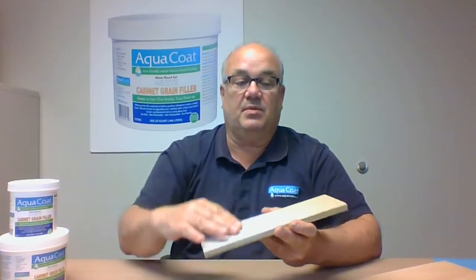The objective of the pore filler and grain filler is to seal the grains and pores. The particle size is very, very small — that's why it has to be forced in. Those particles go in and block whatever you put on top, so less of the surface will be absorbent.